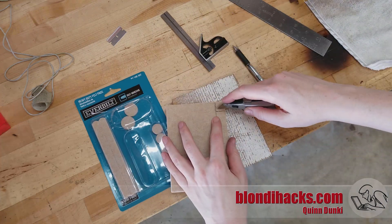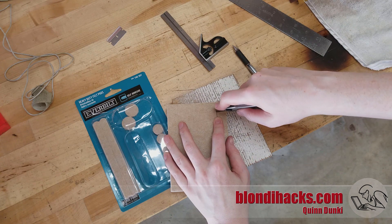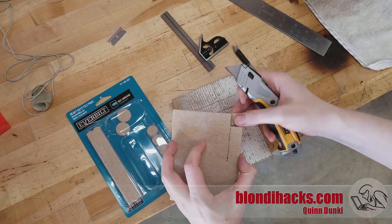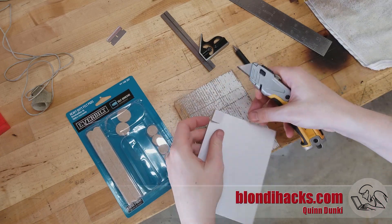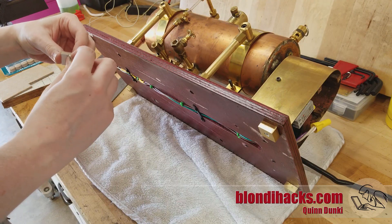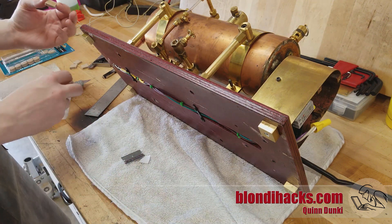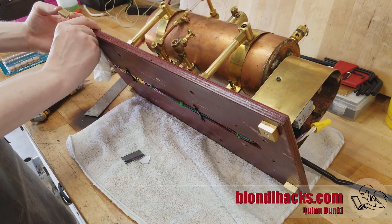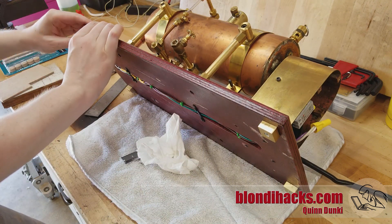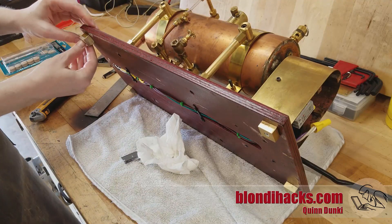Now for the felt feet themselves, I'm just marking that out. This is standard furniture felt you buy at the hardware store, and I'm cutting it with a utility knife. It's got a self-adhesive backing on it that's pretty durable — it'll certainly stand up to this little boiler. Then just peel that paper off; I'm using a razor blade there to catch the edge. I wipe any oil or grease that might still be on there from the drilling operation, and then just press that felt into place. Then do it three more times and we'll be done.